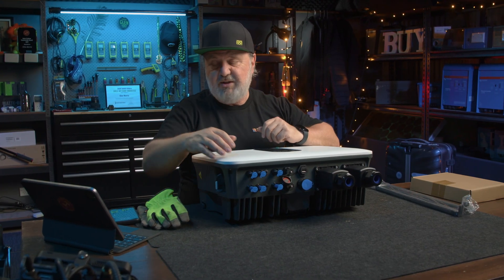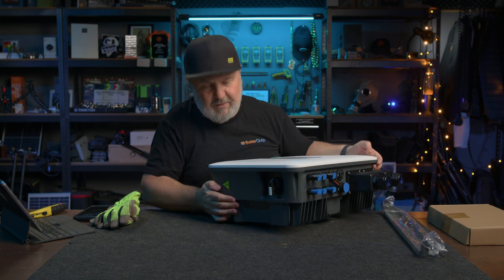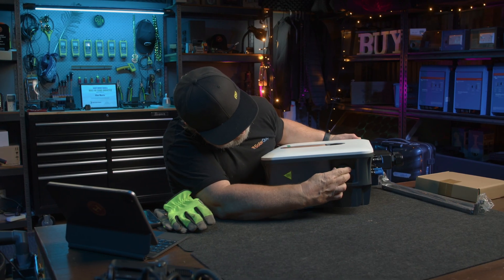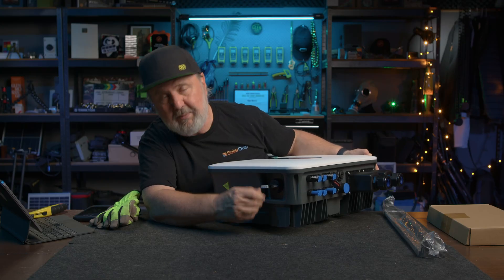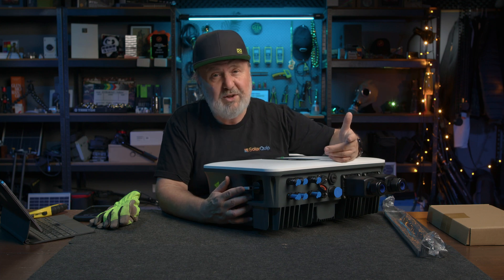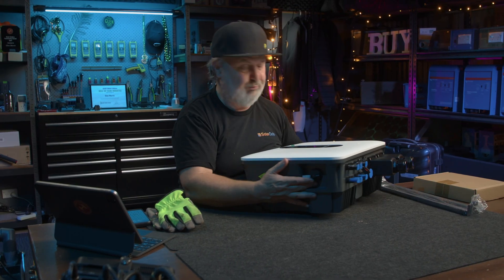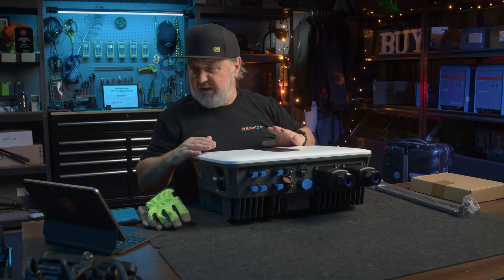It's got surge protection — DC Type 2 and AC Type 2 — and an integrated DC PV switch on the side. It's got a little latch which allows you to lock it in the off position: a hole for a padlock so you can stop it being operated. That means it complies with one of the three criteria in Australia for an integrated DC isolator in PCE — power conditioning equipment like an inverter. An integrated DC isolator needs to be lockable in the off position, marked on and off, and load-breaking. So no external DC isolator required — that's a big time saver and the safety level you'd expect.